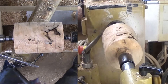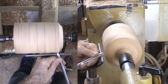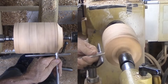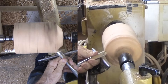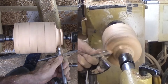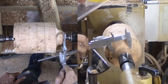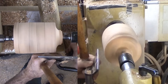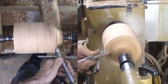With a bowl gouge, waste off wood at the top of the cylinder. Then, using a skew, make peeling cuts at the cylinder corner point down to form a tenon at the end. I'll spend some time measuring and cutting the tenon. The target is for the diameter to be equal to the octagon side. If I can do this successfully, it will guide the next step. If I overcut, my plan B is to mark the side measure with a pencil. The key is to cut straight, avoiding overcutting into the future sphere.